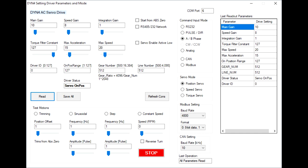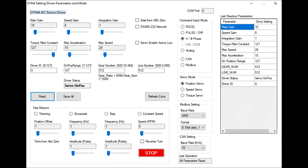If you only want to swing a tool with good performance, a servo motor in velocity mode with analog input should be ideal. Is there a more featureful way to interface the servo motor? Position mode gives great performance at low and high speeds. With some programming, position mode enables orienting the spindle for clocking tools or aligning with the spindle lock for manual tool changes. Position mode is commanded by sending pulses to the drive like a stepper motor drive. In LinuxCNC, pulses are generated using a HAL stepgen component, implemented in software or hardware such as with the PicoSystems USC. Switching to A-B phase — requiring a Dyn4 configuration change and a dip switch change on the USC — solved the pulse width bandwidth problem.